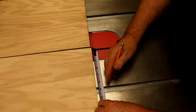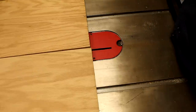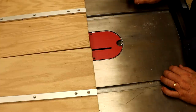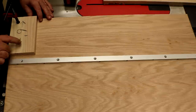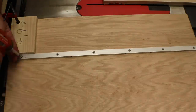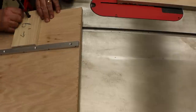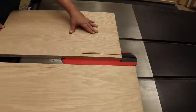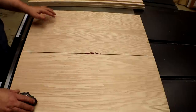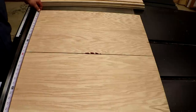To the left-hand side, to the edge of my track measures five and a quarter. Right-hand side measures five. So I'm going to mount my bars a half inch over - when I run them through the saw it'll cut them off. This is a little block that I glued on and clamped on at six inches. Once I have them sitting on the saw right here I can determine my overall width for my back panel - at thirty and a quarter. Thirty and a quarter it is.